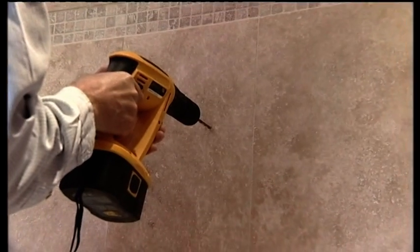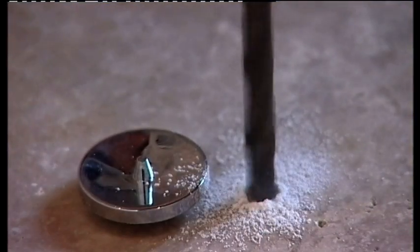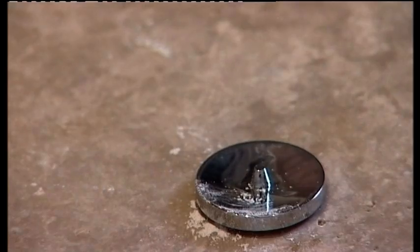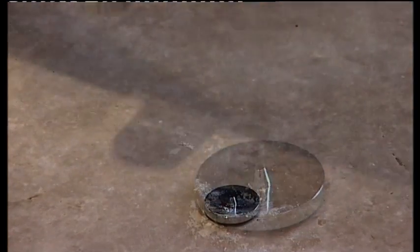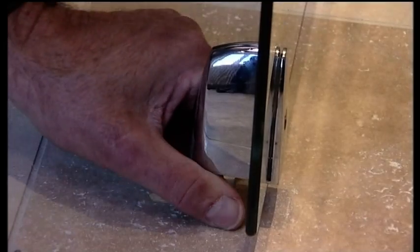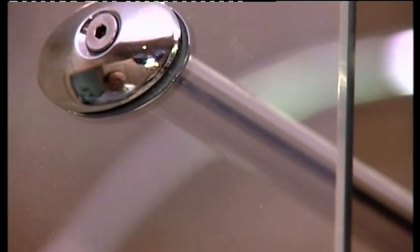Once marked and drilled, secure the profiles to the walls. The glass panels can then be located into the channel of the fixed profiles. Define the foot position on the floor, marking the location of the cup plate. The unique design of the cup plate ensures that it requires no drilling and fixing through the membrane — the hole is drilled only to a depth of approximately 4 millimeters. With the cup plate fitted in position, install the screen by locating the ball joint into the cup and adjust until the glass screen is upright. The cup and ball joint gives horizontal and vertical movement allowing correct seating on the base. Finally, cut and fix the tie bars to the wall and screens.